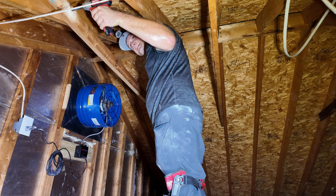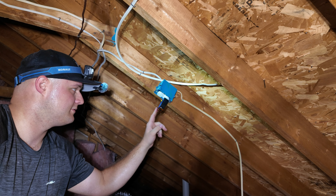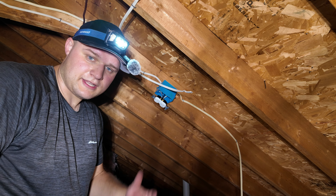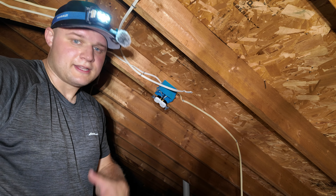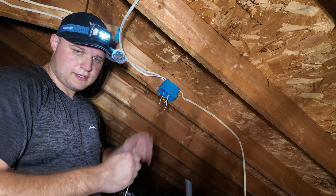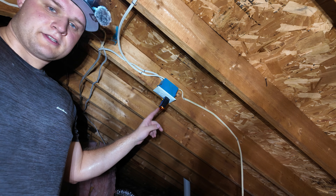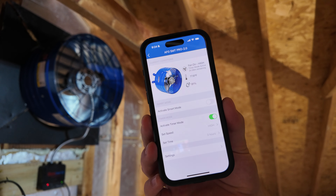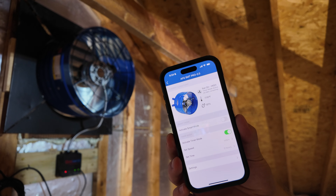This is the vent I'm putting the fan on. I can see two issues: first, the wood extends about an inch and a half past the vent, so I'll need to add a piece of 2x4 to make it flush. Second, a support beam for the A-frame is too close, so I'll need to move it back one — a little more work but not a big deal. Also, all this white powder you see is diatomaceous earth — I have a bug problem, so don't think I poured flour all over my attic.